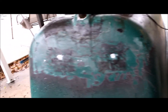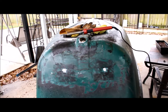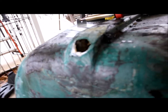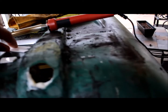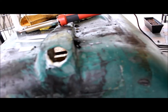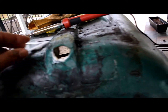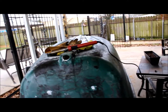As you can tell, this canoe has a couple of holes in it. I'll repair these two small holes here — you got to clean all this up, but we're not worried about that right now. You can see that big hole at the top — I started doing a little repair to it. The tools you'll need are a heat gun and a soldering iron with a triangle tip. You have to use the same material as the canoe — since this is HDPE, I just found a plastic lid laying around the house. So now we're going to start plastic welding these holes up.